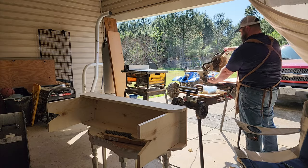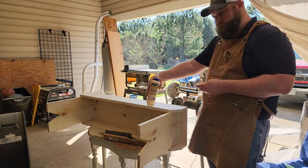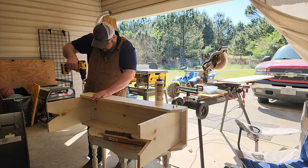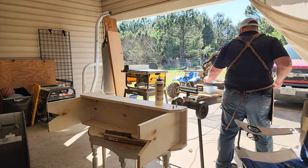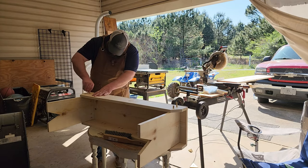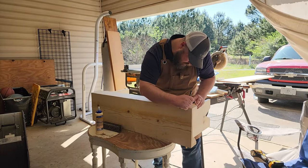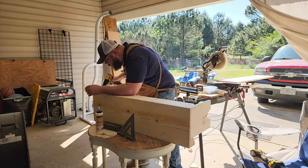Now I'm going to use dowel rods. I was an idiot the first two times — I cut them on the miter saw and they threw somewhere so I had to go find them. The next ones I'll cut by hand with the Japanese saw because those pull saws are great, and I'll use one again in a minute to trim the dowels back off — they're designed to be flexible so you can make really good flush cuts without needing an oscillating tool. You just cut it smooth to the surface. If you have any gaps or tear out, you can use wood glue and mix in some powdered sawdust, then paint right over it after sanding smooth. But if you need to stain, use a sandable wood putty instead because you can't stain Titebond.